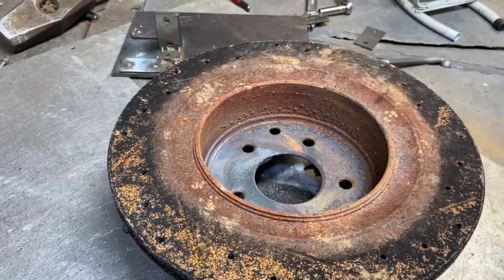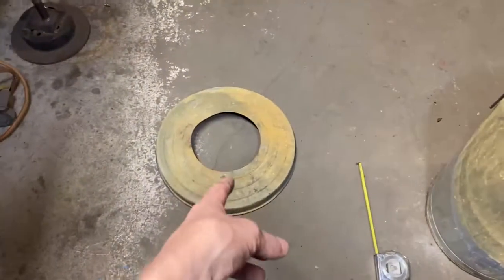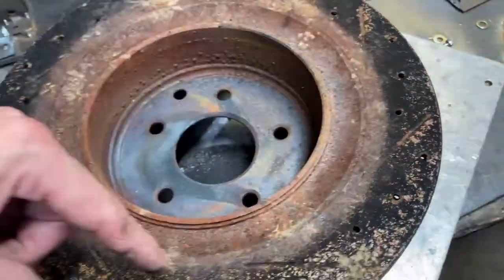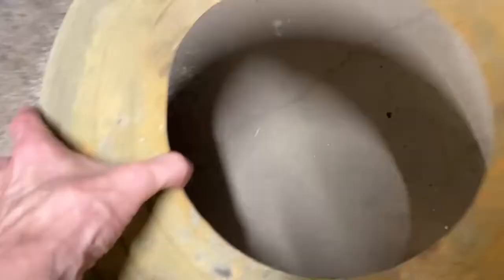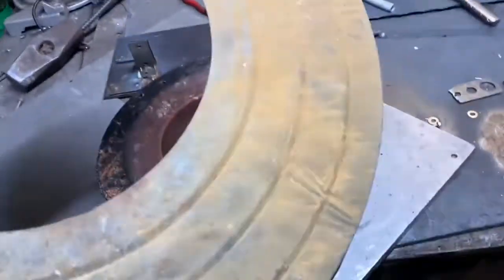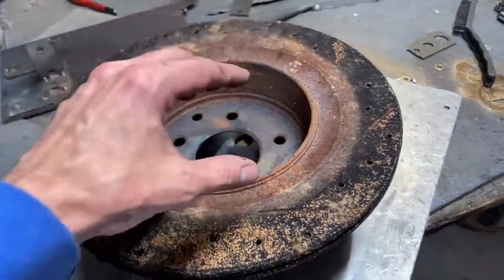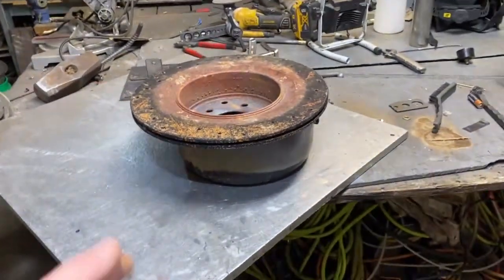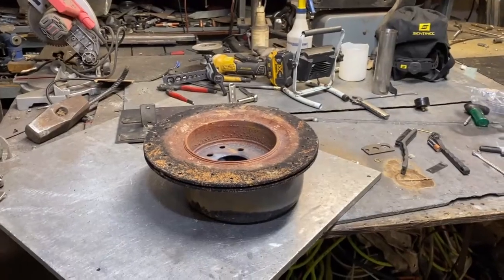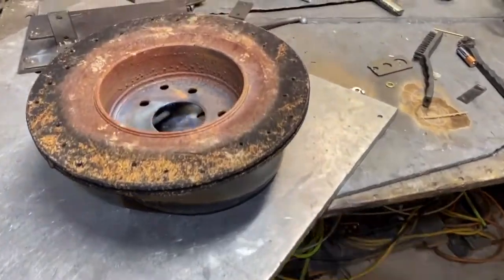This part gets red hot and that helps vaporize the fuel and definitely helps keep the flame burning properly. The flame burns from this inner cone — from the vaporizing gases coming out of there — up to the top of that hole, and it burns as a column fireball. It does not go past this column area. See how we have this black soot here — that's kind of where the fireball was burning. The size of this hole at the top dictated the size of the fireball all the way up. We have something to retain heat — it can literally be anything, just thick metal — and you need a fuel pan to keep fuel from getting into an area where it won't combust. You could get over-flaming when the excess fuel ignites, pushing smoke out of the system. This has to be 100% combustion.